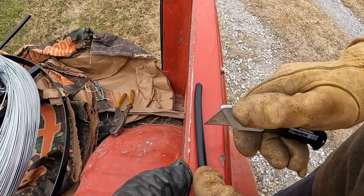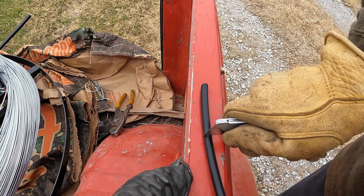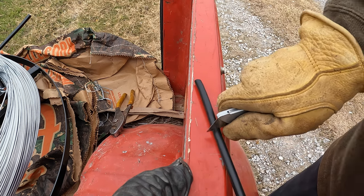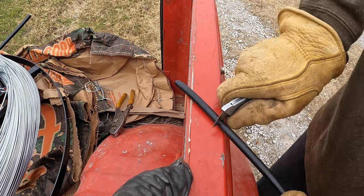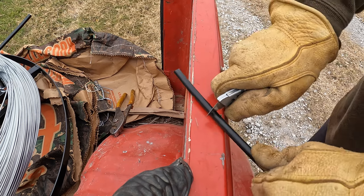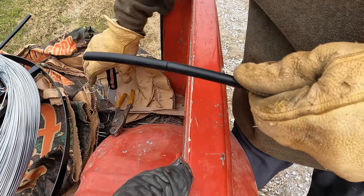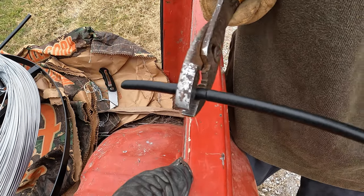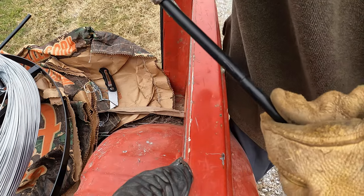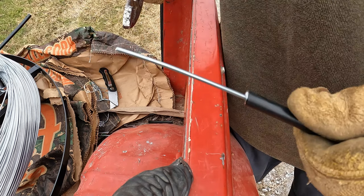So here's my insulated cable. I was going to show y'all — in case you get 12 and a half gauge insulated underground cable that you're using for your jumpers or to go under the ground at a gate or something like that. You just kind of score it around like this with your blade. Be careful because if you slip, obviously that blade's sharp. So you score it all the way around, then you take your set of pliers and you just twist it. And you see it came loose. Then you just come to the end here and it just pulls right off.